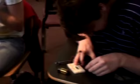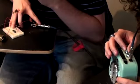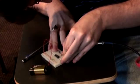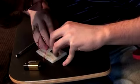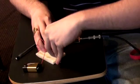You should be able to still get it. These things are not directional. The big black one is. Yeah, try the smaller capacitor. Did it work fine with that? This should give you something. Try changing the pins. Oh, this motor is not going to work. It's that motor.